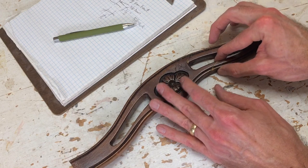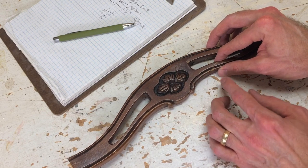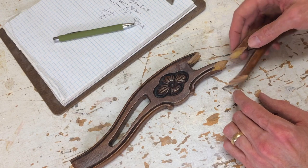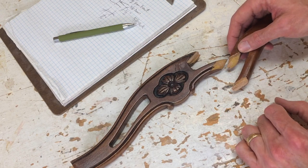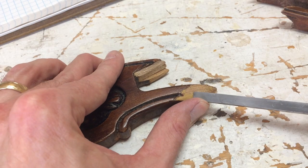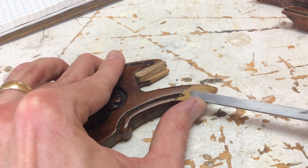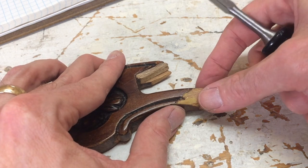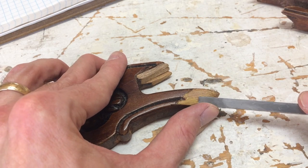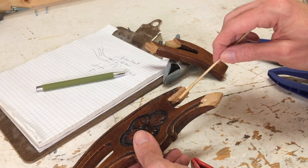There are four things you need. One is a tight joint. One is a clean surface. One is clamping pressure. And the other is spreading enough glue across the whole joint. And you can see here, there wasn't enough glue across the whole joint, and that obviously wasn't clamped. So I have to clean out this old glue because glue doesn't stick to glue unless you're dealing with hide glue. And because this is a failed joint here, and I'm not exactly sure I've got a perfect fit, I'm going to be using epoxy to glue this joint.